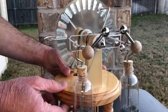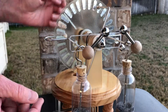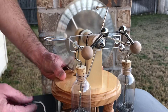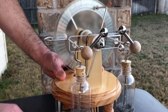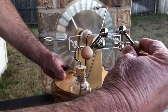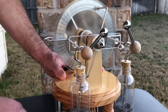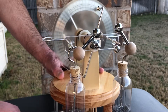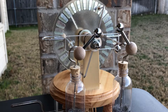Anyway, that's about it. This is impromptu and I apologize for the lack of organization, but this machine is built more than anything to be attractive — not just to have symmetrical balls. It's not going to produce really long sparks. One way to ensure long sparks at all times is to have smaller balls on top of the larger balls — I call them primary and secondary balls — and that way you can get very long sparks very easily.